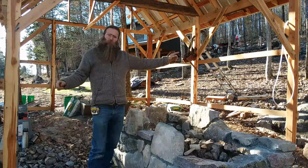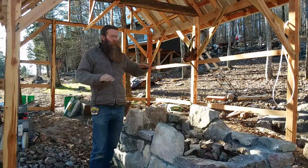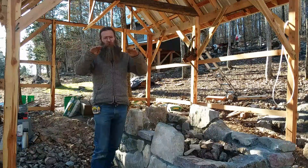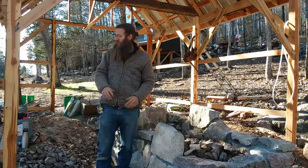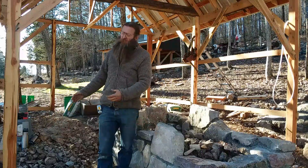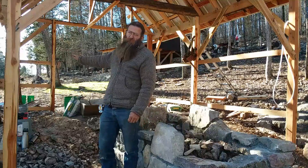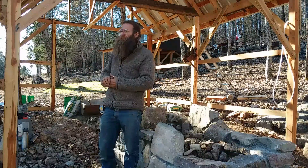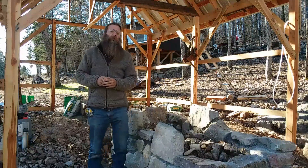The width of our building from point A to point B is 12 feet, and the amount the side of the hill is out of level is around four feet over a 12-foot span - that's a considerable distance. How we're dealing with that is we've got a dry stack wall coming in here with a lot of backfill. We have a little area around this way where we're trying to clear out to make sort of a field yard.